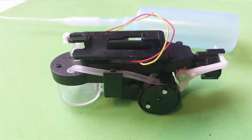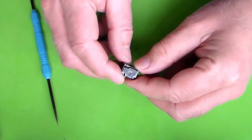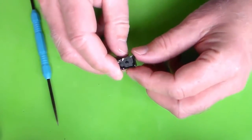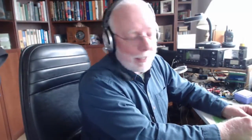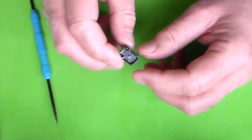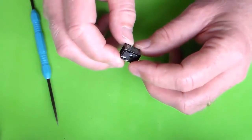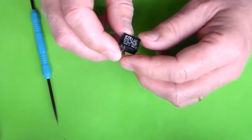Using the IO pins to drive the ultrasonic sensor is one thing, but when it comes to running the motor on our bubble machine, that's another. That's where this little guy comes in — it's a little miniature relay. I got it at Radio Shack. It's got pins on it to run a coil to open and close the relay, and a common pin over here. We can apply 5 volts and open and close the contacts that will run our bubble machine. And it plugs right into a breadboard.